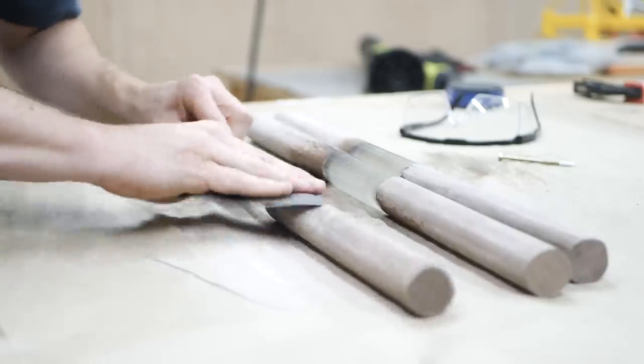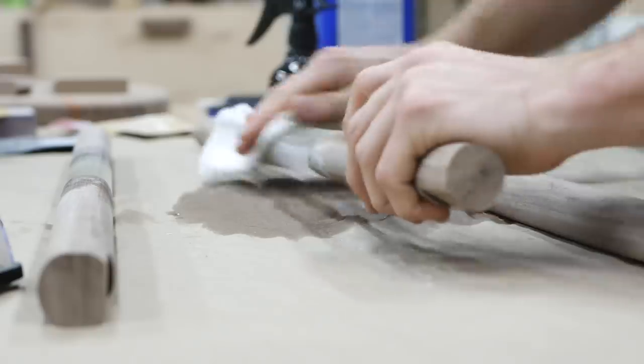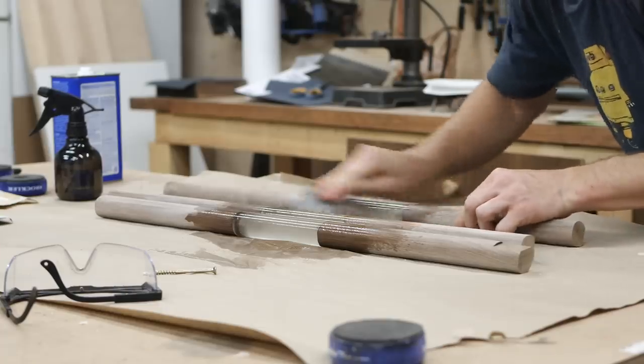Having never done this, I knew the process was to basically sand from 400 where I had left off the previous day and up to 1500 grit. Sanding up to 1500 would remove basically any and all visible scratches from the epoxy, and then buffing things out with plastic polish would bring out the clarity in the epoxy.